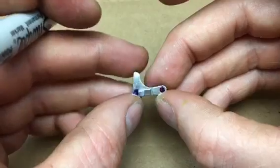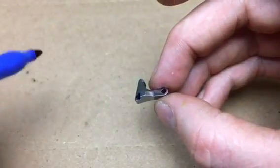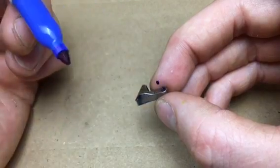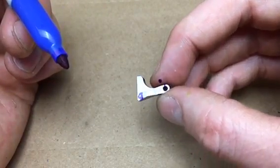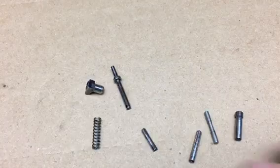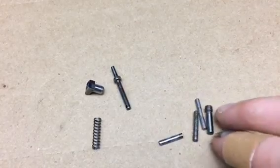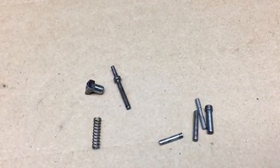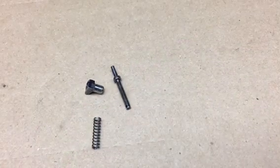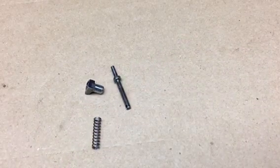Most people, if they make a mistake when they're setting up one of these guns, they neglect polishing the inside of the holes and polishing the pins, especially the inside of the holes. That is huge. Okay, all your pins in the gun. If the piece of steel on the outside of them pivots, moves, whatever, polish them all like crazy. All right, got that covered.